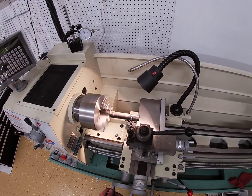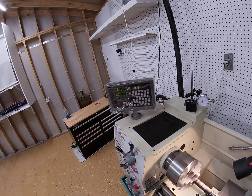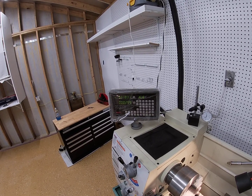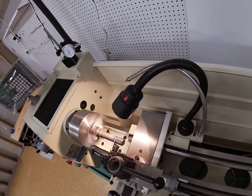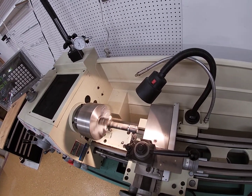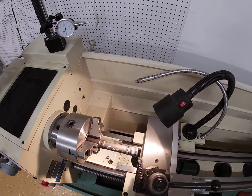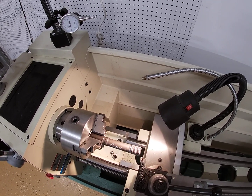Okay, you should be able to back it off — it was back-cutting. So we'll back this off to negative. Let's see if we've cut anything. Okay, we have cut some off of that — so far so good. That was 20 thousandths.